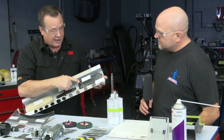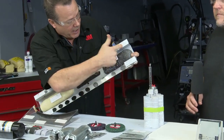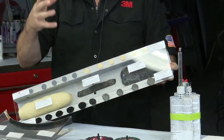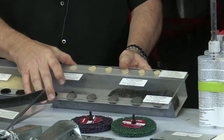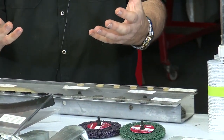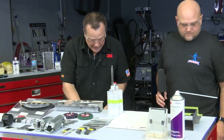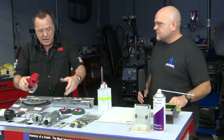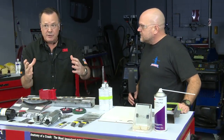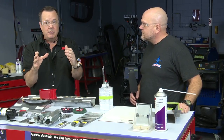So let's say it's a flexible foam, and I don't know how well you can see that, but I've got some foam here where you can actually extrude the foam out onto some plastic or something that you can remove it from again. Another solution, excuse me a sec, is packaging tape. So if you extrude it out onto some clear packaging tape and allow it to expand, and then trim it to the size of whatever cavity you're putting it in.